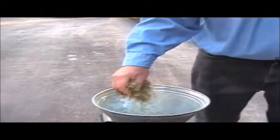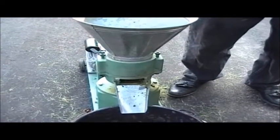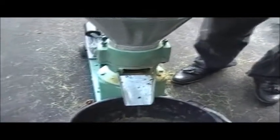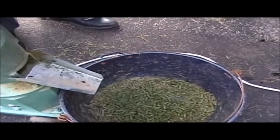To begin, I'm warming up the die — that's the part of the machine where the grass is compacted into pellets. The process of pelletizing, simply stated, revolves around the complex chemical compound present in all plant cell walls called lignin. Lignin is the glue between the plant cells. The force and pressure used to compress the grass into the die creates heat. The heat turns the moisture in the grass into steam. The steam transports the lignin throughout the compacted grass and becomes the glue that cements the particles into pellets.